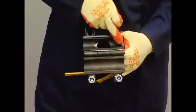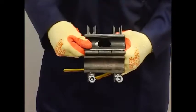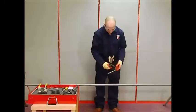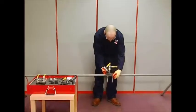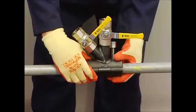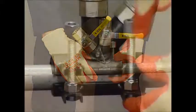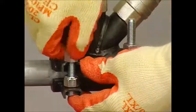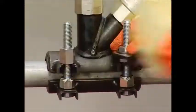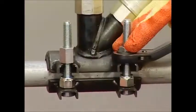Open the clamp and check that the rubber is not damaged, then fit the clamp onto the service pipe ensuring that you have sufficient working space for cutting off the service or for any further work. The angle valve should face the direction of the flow of gas. Tighten down the bolts using a hand ratchet or spanner, remembering to tighten the nuts evenly. Don't overtighten, but ensure that the clamp is firmly attached.